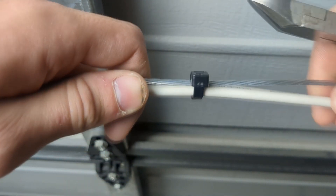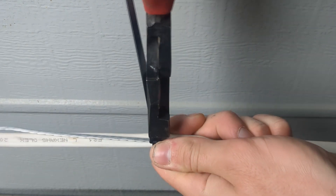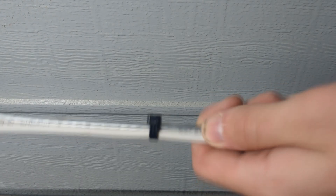When you're securing cables with cable ties, you just slightly pull on the tail end as you cut close to the head. Snip, and you'll notice the tail will slightly retract back, giving you that smooth finish. As an extra tip, if you only have your combis or linesman pliers on you, you can use the head of the jaw to twist the cable tie end in one quick motion to get that nice finish. Really, you want a clean cut because it looks aesthetically pleasing and it helps out the next trade after you.